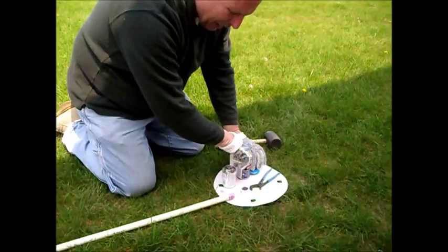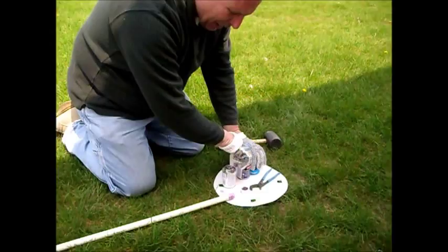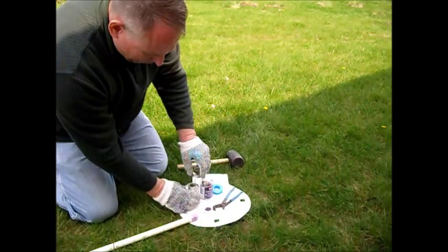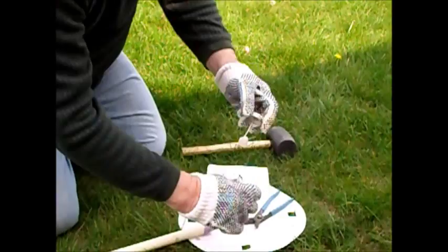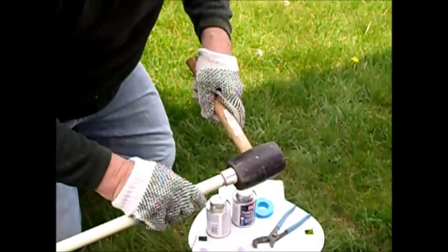Then you take the cement — it does have a little bit of an odor to it also, so it probably ought to be done out in the open. You just put that around the edge here, make sure you cover everything. Double dip this portion here, give it a little tap, hold it in place, and wipe off the end. Then put a little plumber's tape on the screw end — it keeps your threads and allows for a tighter seal so you won't get any squirting.